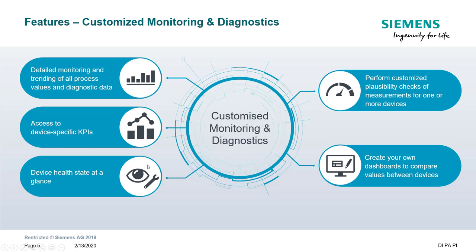The device health state is monitored to the NAMUR standard NE107, so you get the NAMUR symbols. You'll be able to see the full history, so if you've had an intermittent fault you'll see that it's gone. You can also require acknowledgment of faults, so maintenance people on site need to clear the alarm history. And as mentioned, you can create your own dashboards across devices, which is quite a nice function.